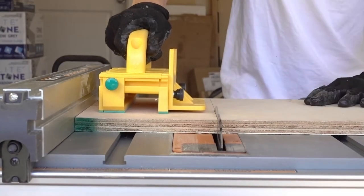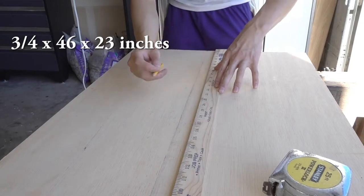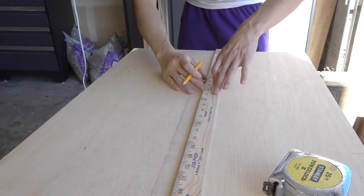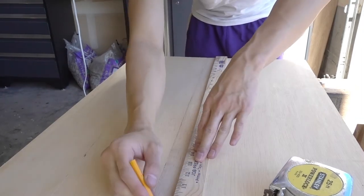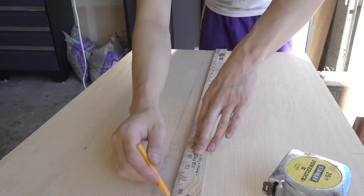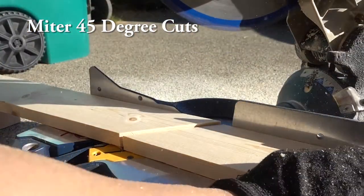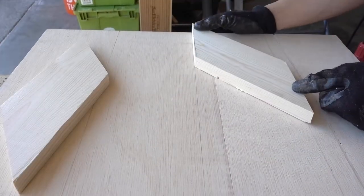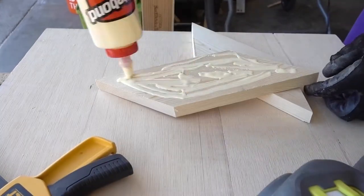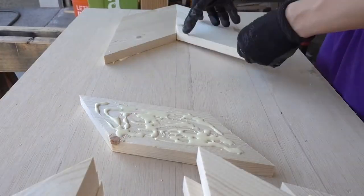Here you see me cutting my leftover plywood from my garage — it's three-quarter inch thickness and I put it together to use as a canvas. Measure the width of the plywood and draw a line straight down the center; this will be your reference point for laying down your herringbone design with the 1x4s. Next, use your miter saw to cut the 1x4s at 45 degree angles, then use a brad nailer with one and a quarter inch nails and glue them down on your reference points, and use clamps.